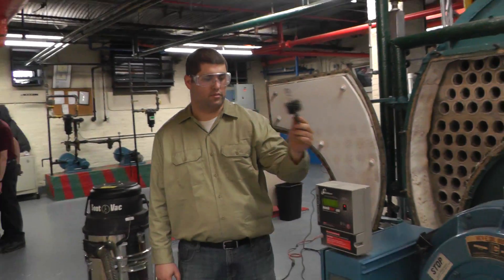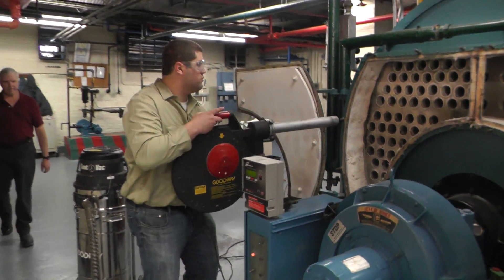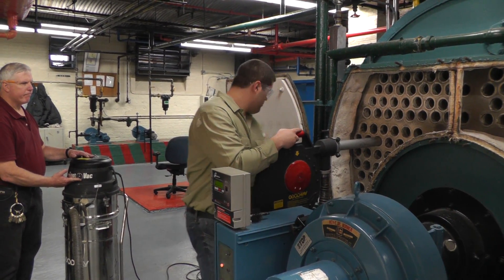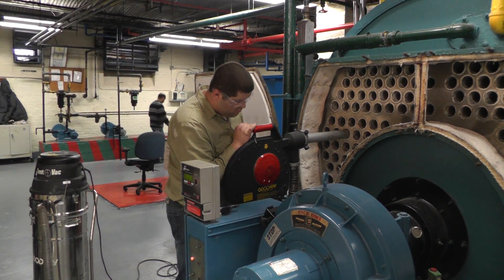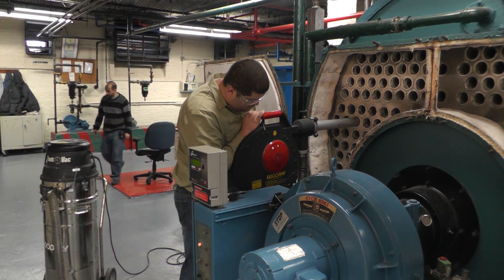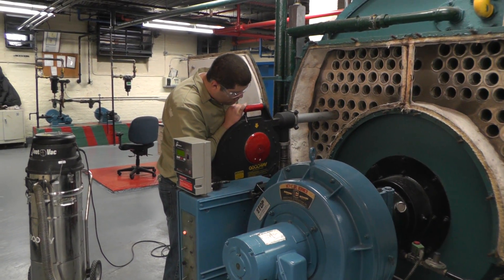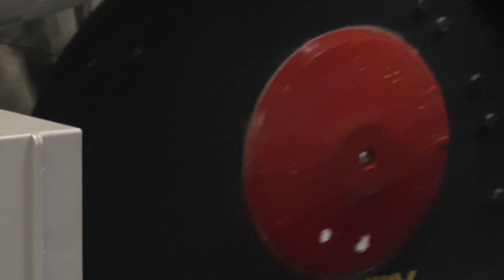Let's put the gun in and punch some tubes. It hits the toggle switch. Right now it's cleaning the tubes at three feet a second. The steel tape inside the gun is pushing and pulling the brush in and out. You have a distance indicator on the side of the gun that tells you how many feet in you are, so that you know when to stop the gun.